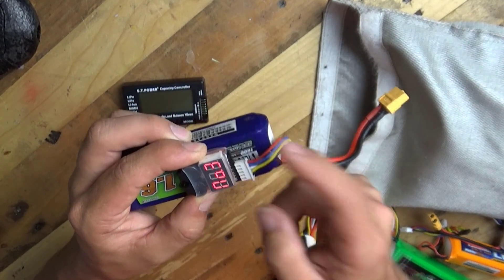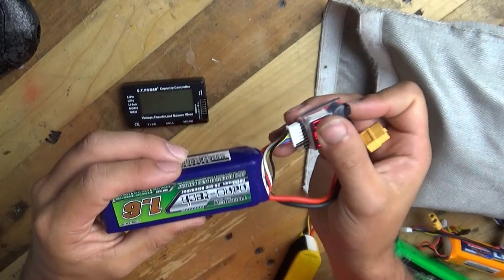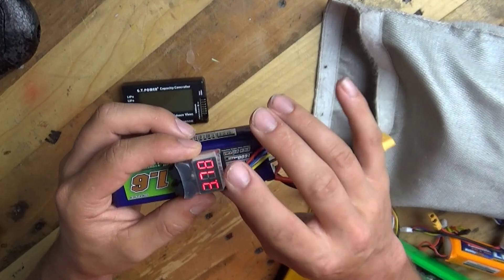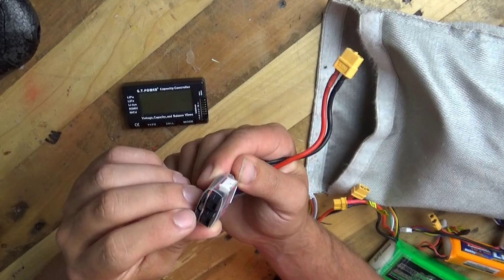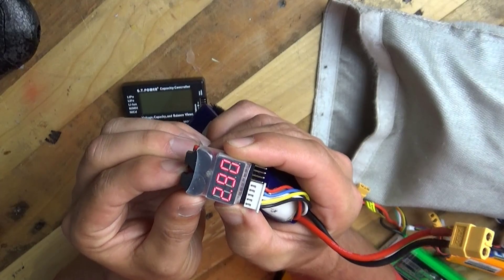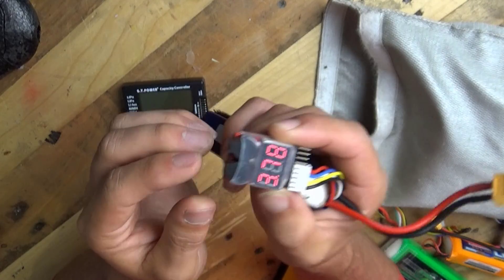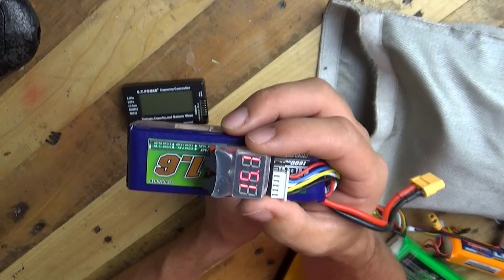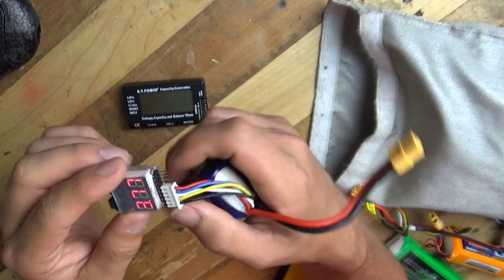Remember — big tip for you: put the pins away from the battery just in case you have an unscheduled landing. You don't want the pins or the battery forcing itself into those pins. Make sure the pins are up out of the way. It's great because you can press the little button on the top of the device itself, and then we can go through the different voltage alarms. So maybe you want to set yours to go off at 3.5 volts — you're smashing the battery, and when the battery alarm goes off, you know you need to land pretty much immediately because it will beep at you, and they're really, really loud.